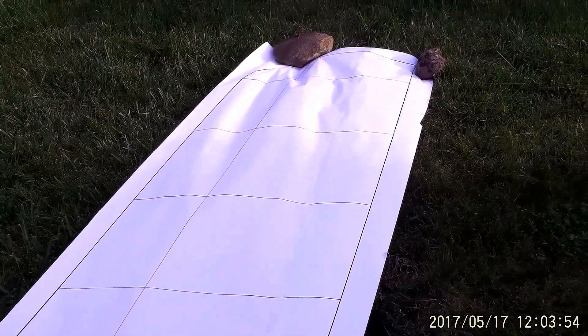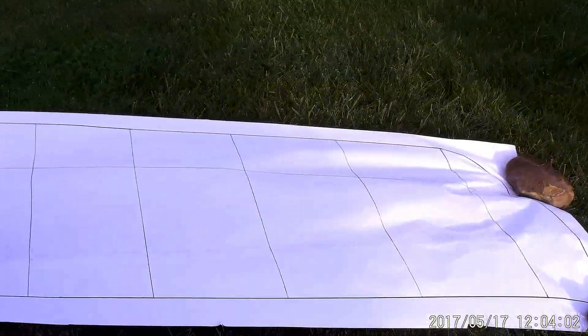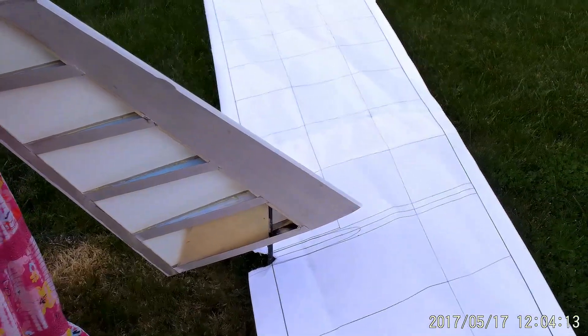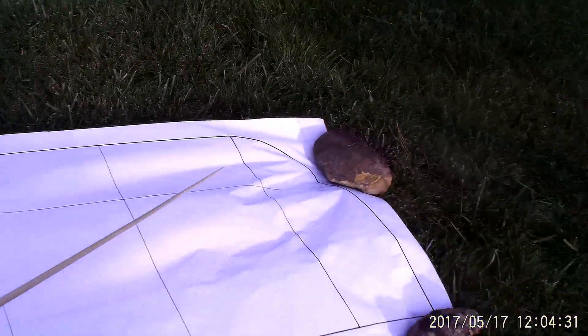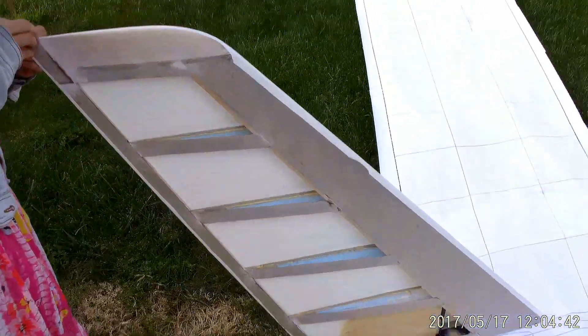Over here we have the last four or five feet of the wing plus the wing tip. This part of the wing will be constructed in pretty much the same manner as the winglet itself — conventional wood construction. On the other side of the winglet you can see it's not covered; it's made out of plywood and styrofoam and carbon fiber and fiberglass, a variety of components. I'm going to make two different wingtips: one with a composite leading edge, one with a plywood leading edge with a carbon fiber tube along the entire leading edge — we'll see which is lighter and more durable. The wingtip out here is going to be a balsa wingtip, much like on the winglet itself, where the plywood ends and it goes to balsa wood. Balsa is a wonderful material for aircraft — light, strong, and easily repaired.